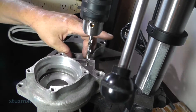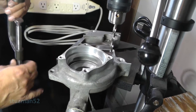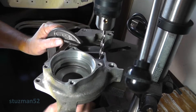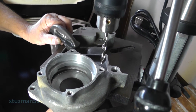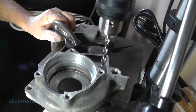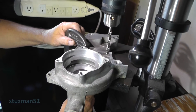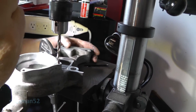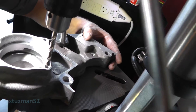I don't want the piece to be moving, so I'm going to put a C-clamp on there. Because once we get that drill bit centered over top of that hole, we do not want this piece to move anymore. We've got to put a tap in there after this drilling operation, so we want to make sure that the tap is going to be coming straight down into the hole. Before I lock it down with the C-clamp, let me check one more time — just want to make sure that we are still looking good.